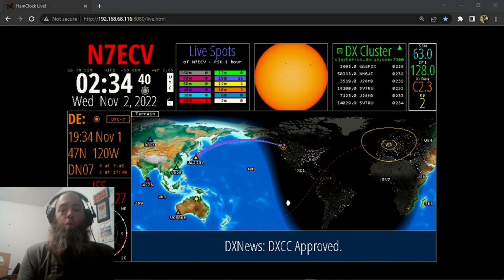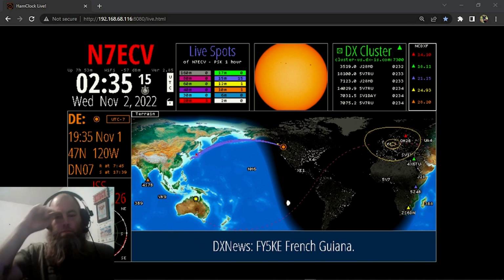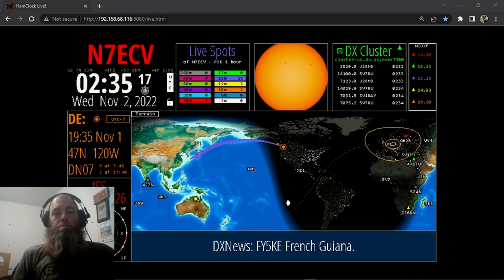This is from a CW company. They pretty much come tuned flat or a 1.5 or under. It's usually about 1.2 with this configuration I have on this thing in the digital portion. So FT8, you can run full power if you wanted to and never have a tuner through all those bands, really. Doing really good. Good performance, as you can see here, as some of the stations start to light up through the band there, and just kind of get better. You tell me after it's done here which band would you choose.